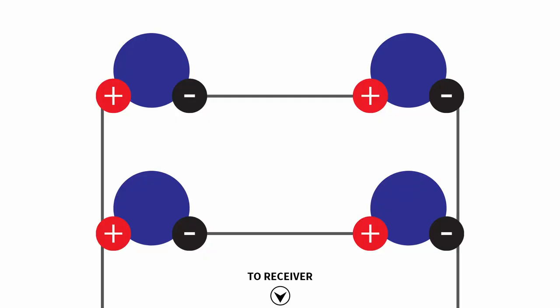I asked about the wiring in my previous video because I wanted to maintain the 8-ohm load. I put up the diagram of what I was thinking of doing, which is what I ended up doing. Unfortunately, and thanks to Captain Tech Review for pointing this out, the way I'm wiring them now actually brings them back to a 4-ohm load. This made me wonder if I should still have them powered by the Anthem MRX1140. It is rated down to 4 ohms, so that's not a problem, but it would probably work a little harder than driving an 8-ohm load.